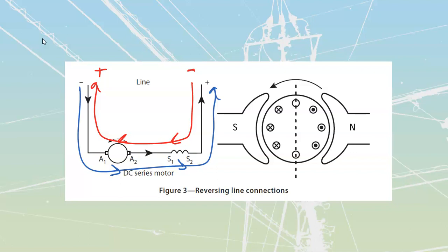We have to always select either reversing the armature or reversing the field. Of those two, the most common way to reverse direction is reversing the armature. Don't fool around with the fields, because once we get into compound motors you'd have to be very careful about which fields and how many you change.